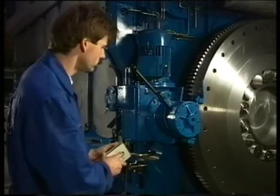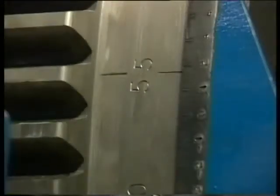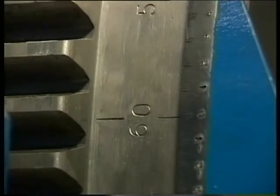Place, if necessary, the slide and turn the crank 60 degrees through top dead center toward the exhaust side. Use the manual control of the turning gear device to bring the crankshaft into the correct position.